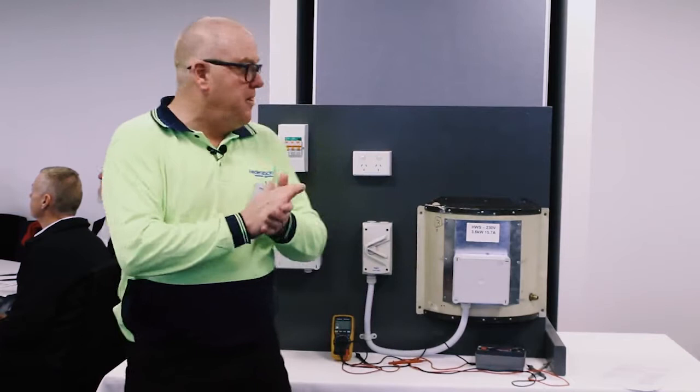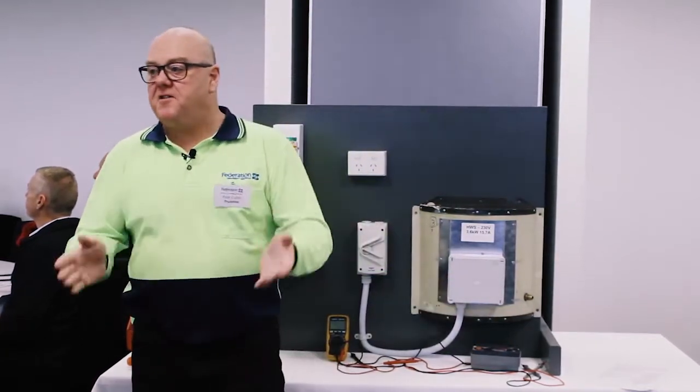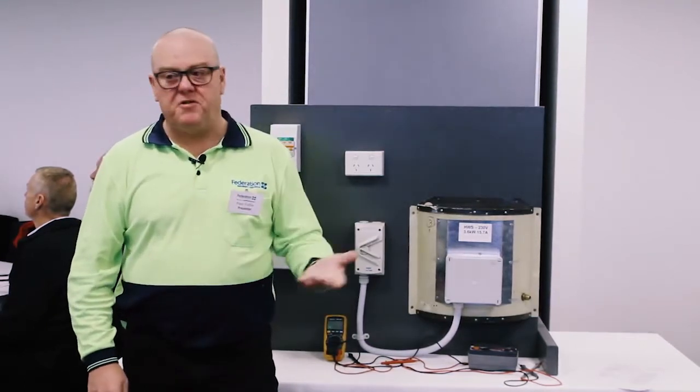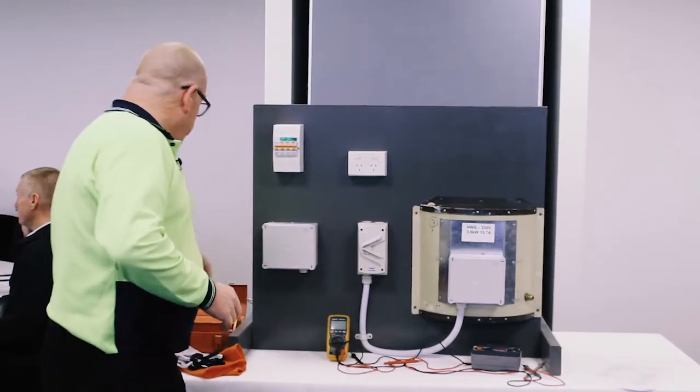So I've wandered in. What's one of the first things we do? Grab the IR tester. We've done a test and checked it on a 1 ohm and a 1 meg ohm resistor to make sure it's accurate enough for the candidate to use in the assessment. As Sue says, there's no traps in that. Is it right? Yes? No? Danger tags.